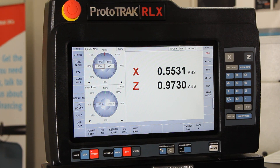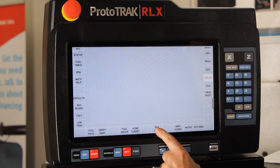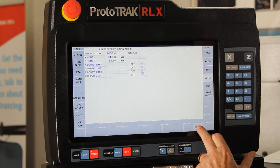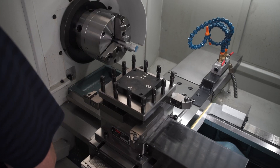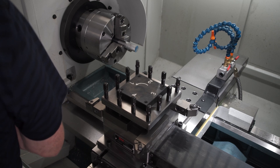The next thing is return home. The return home position is set from your setup mode under references — you'll see it's set at three and three. I can change that number or keep it. From the DRO mode, I'll keep it, so when I push return home and then push go, it's going to move to three and three. That's just your home position where you can rotate or change tools.